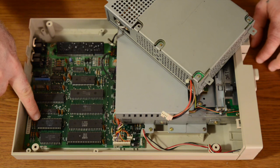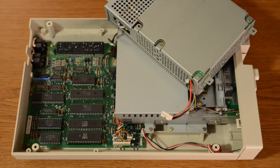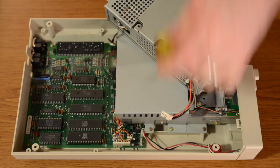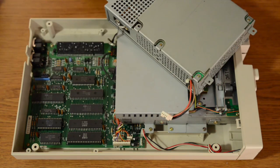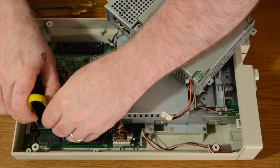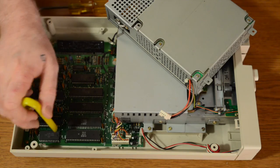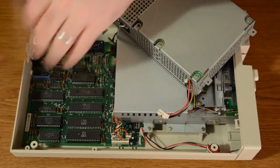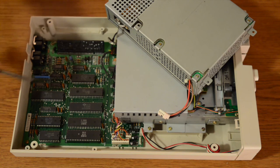What we're going to be replacing is this chip right here. Next, you're either going to get your EPROM puller or your screwdriver and you're going to pry it out. With the EPROM puller, you're going to attach it and gently wiggle it out. With the screwdriver, you're going to get it from one end or the other and gently pry it out.